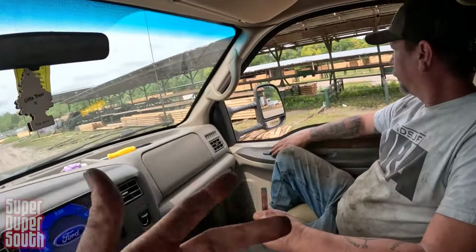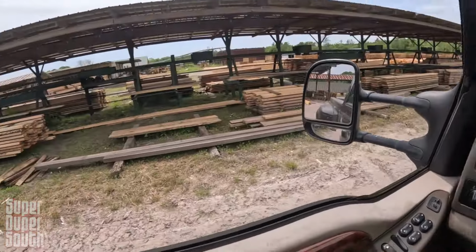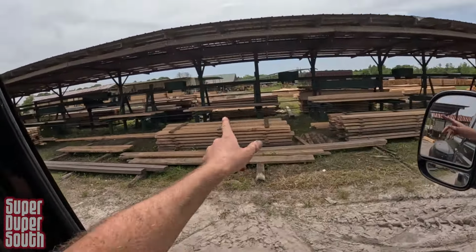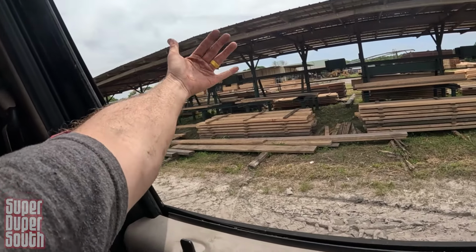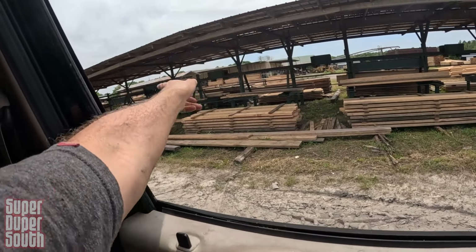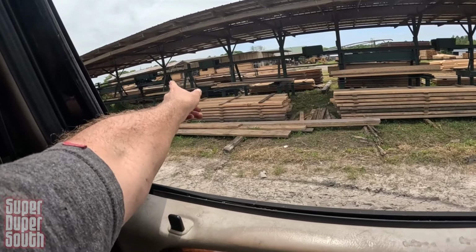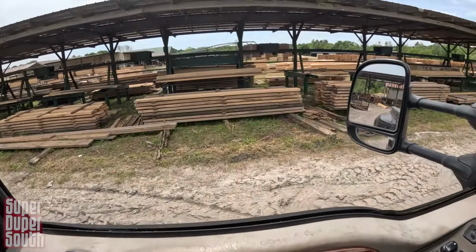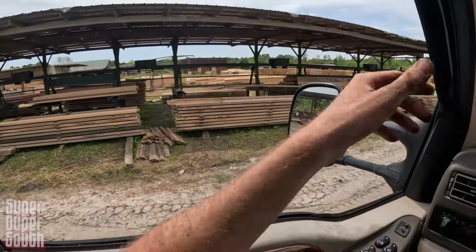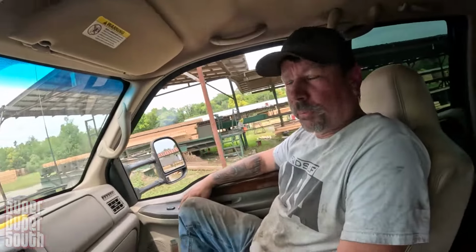And on our 3-inch, like I said, you have nothing but 3x8s on that side and 3x6s on the opposite. More or less, after the 2x6s, there's a rail, a piece of angle that just keeps the top from falling over. So once those get done and it goes to 8-foot 2x10s, we just delete that rail, so then the 2x8s can fall off. And the same thing on the opposite side. And over here. Yeah. A little bit of redneck modifying.